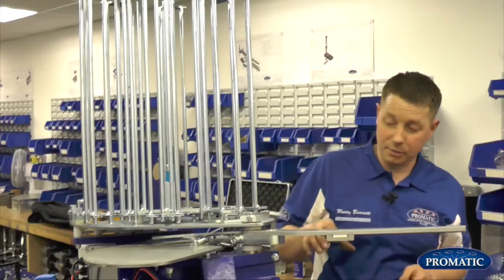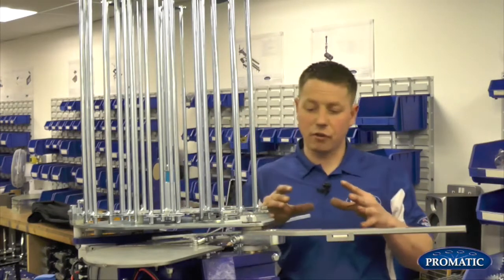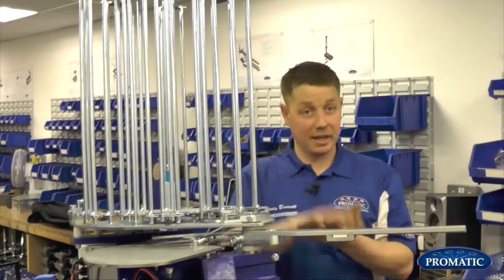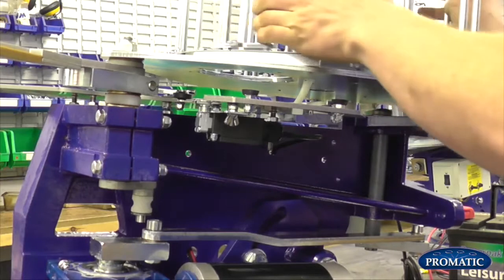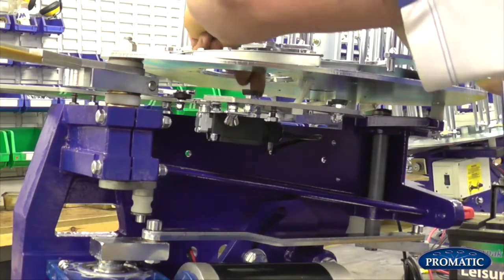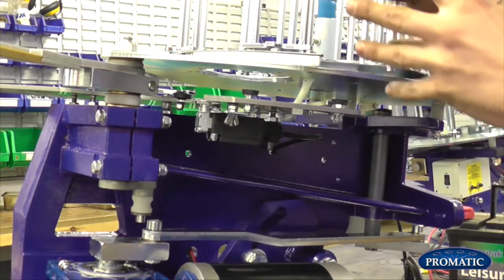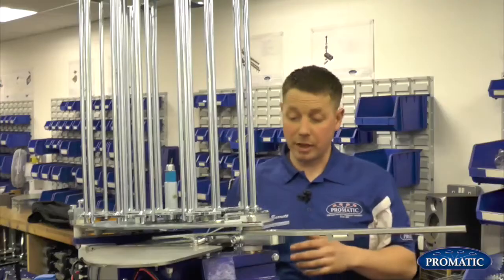A soft fall plate is probably the main one actually under here. Make sure your soft fall plate has some bounce in it. It acts as a shock absorber for you when your clay lands. You don't want it like a trampoline, so it's really springy. You want just a nice little bit of play in it. As we're tapping that now, there's a little tap, and that just takes the shock out of the clay when it comes through your knives and lands on your soft fall plate. If all of them are set correctly,